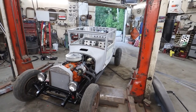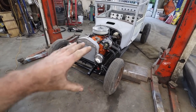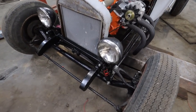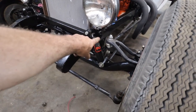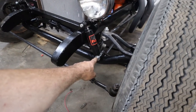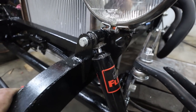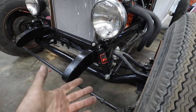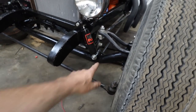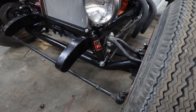Alrighty, folks. So we had a successful run last round. I have learned since my suspension is settled that I goofed up with my front shocks. So I'm going to have to revamp something here. I think we're going to have to make a new mount because that's not really enough suspension travel. They're short shocks and all, but I'm going to have to make a new bracket and kind of bring it down a bit or something. We'll figure it out. It's not that big of a deal.